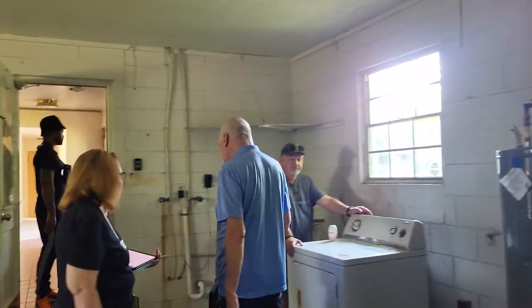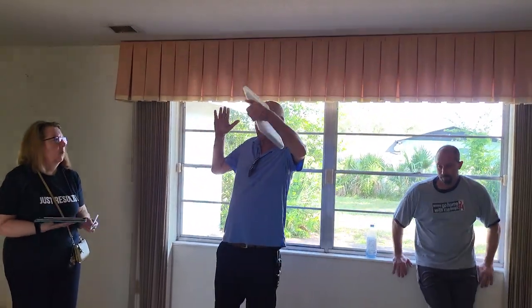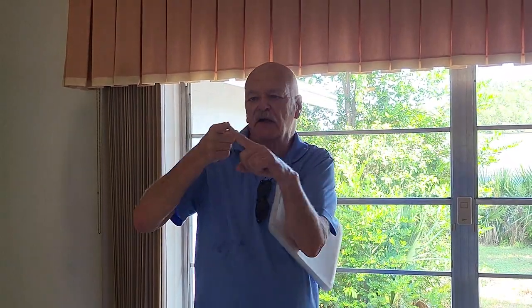Now let's talk cosmetics. If you don't have construction knowledge, you need to know which wall you can take down and whether it's a bearing wall. Bearing wall means it's supporting the roof structure and ceilings. On a ranch-style house like this built in the 60s, it may have rafters — two-by-tens or two-by-twelves coming up to the peak with a ridge board, and collar ties across. Either way, trusses or rafters, they're going to run from front to rear — always the shorter span.